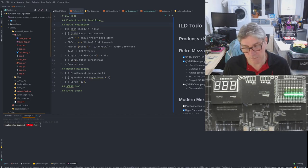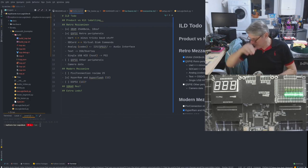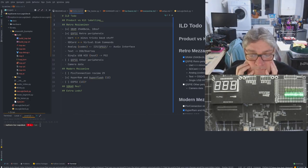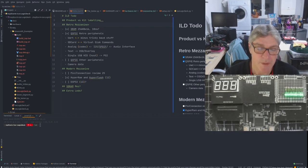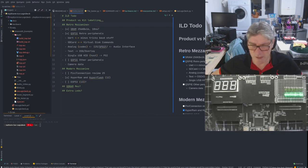One thing you could do is you could use it to bring video into the ESP32, from the FPGA. But, right, so here's my thinking of what's possible. Right now, I don't think we can do a QSPI between the MicroPython, for example, or CircuitPython and the FPGA, because there is no quad SPI support. Not only that, how the event stuff would work is kind of tricky in MicroPython. It's not very responsive from a real-time point of view. So you wouldn't want to be doing anything real-time like that.